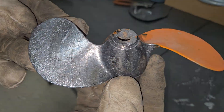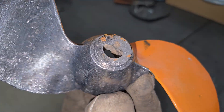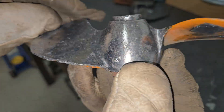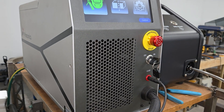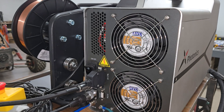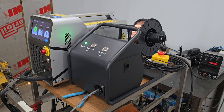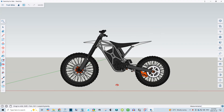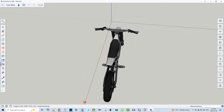So that's it for this video, folks. I'm really pleased with how this welder performs. At just 700 watts, it's definitely not comparable in power to a typical 3 or 4 kilowatt MIG or TIG welder, so don't expect to weld something like half-inch thick steel plate with it. But the results that I got welding and cutting material that was twice as thick as it's rated for without any problems was pretty impressive. Let me know what you think in the comments. If you'd like to see more of this machine, be sure to subscribe, because I'm going to use it to finally build the tube chassis for my electric dirt bike over the next couple of weeks.